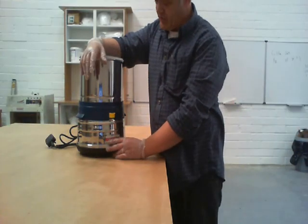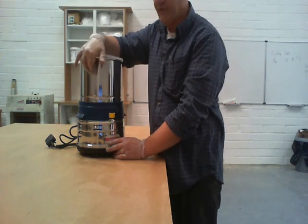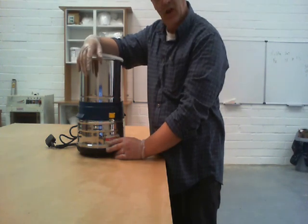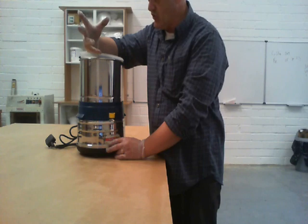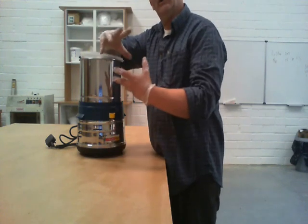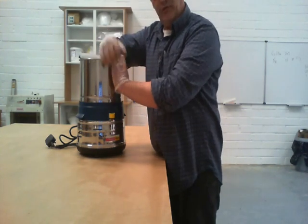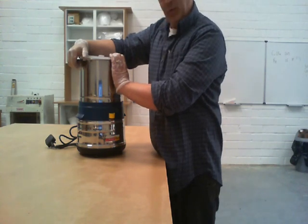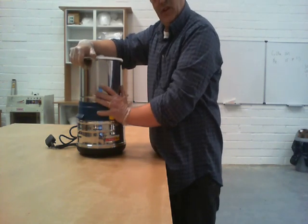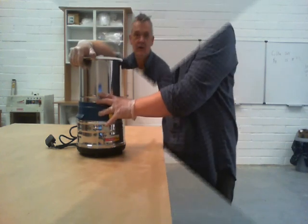I have a couple of these — these are automatic muller grinders. You've probably seen me use this before. It's a wet grinder and it's a shear process that is low energy but does some quite remarkable things for mixing. It mixes very thoroughly and applies a shear force. They'll just run round and round for hours doing that quite happily. I have two of these to use for mixing pastes and inks.